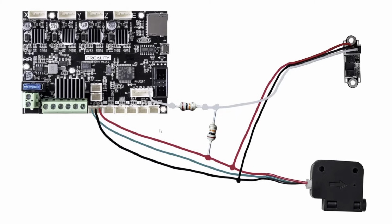Showing how to do the wiring is best illustrated using a couple of diagrams. First one here is this back of the napkin chicken scratch diagram, but you can see the actual photos of the units. So these two things here are the 10,000 ohm resistors. I had you order a few of those. So this one right there that connects the positive line to that signal line, that's called a pull-up resistor.